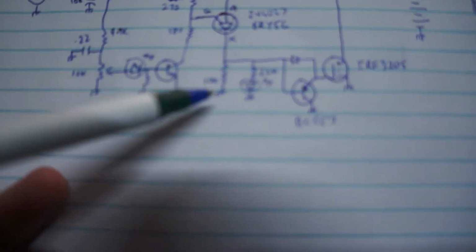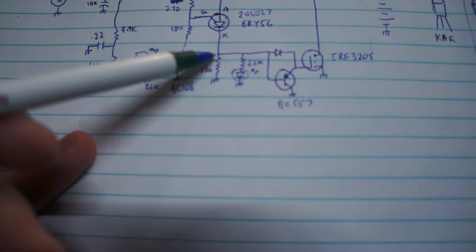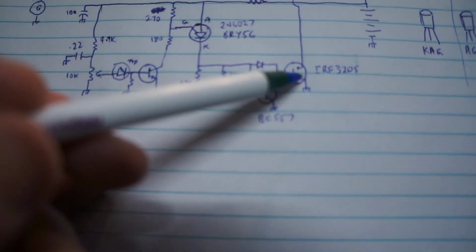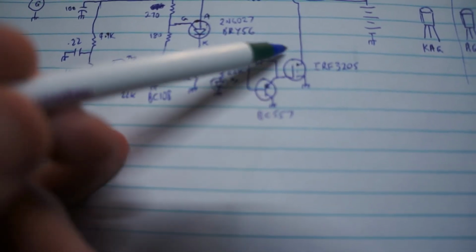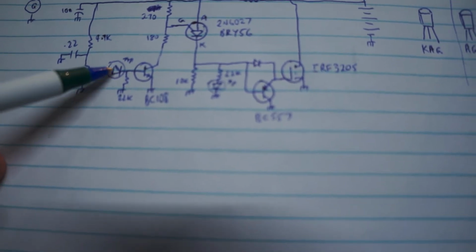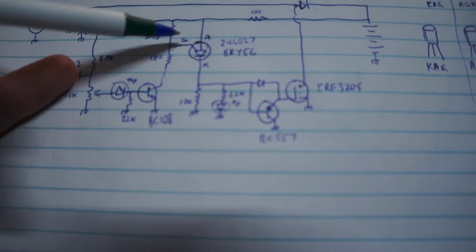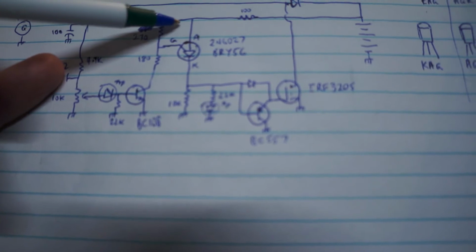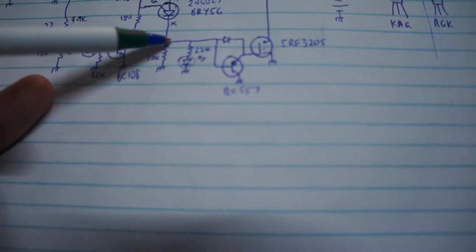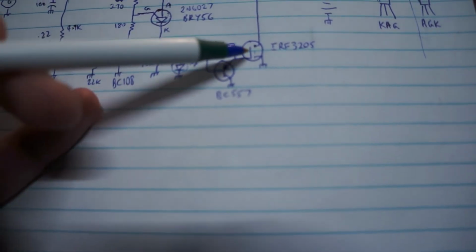And when that happens, we get the full supply voltage as well, maybe a fraction less than the full supply, going into the gate of the Mosfet, and that stops the generator charging the battery. Battery voltage starts to fall, red LED stops conducting, and so does the error amplifier, which allows the gate voltage to go back up to the anode voltage, which switches off the PUT, and in so doing the voltage at the 10k resistor suddenly disappears and the Mosfet switches off.